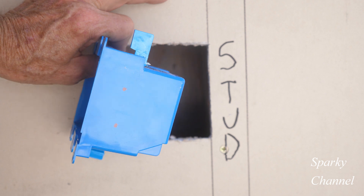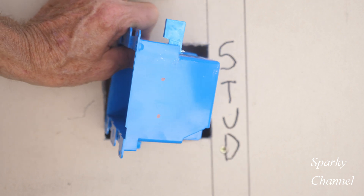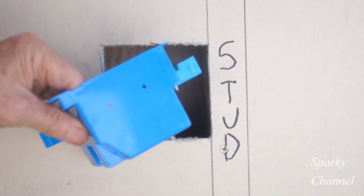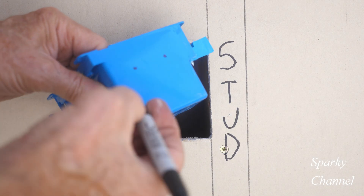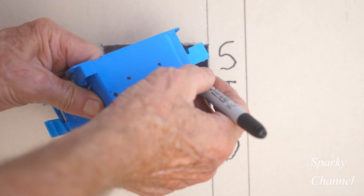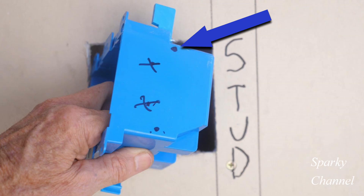Why would you like to make this modification? Because I'm going to be installing two receptacles into this two-gang box, and I'm concerned that the box won't stay stable over the years just using the wings of an old work box. So you're proposing to use both the wings of the old work box and two screws? Yes. Okay, I'll approve this modification, but I want you to put the screws closer to the top and the bottom of the box, here and here. In this way, your screws will have less chance of contacting your wires.